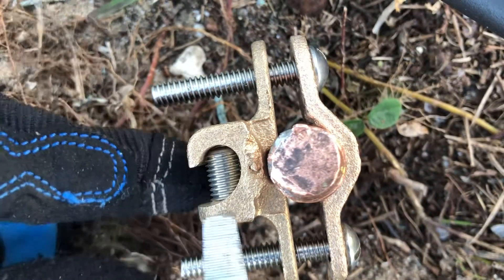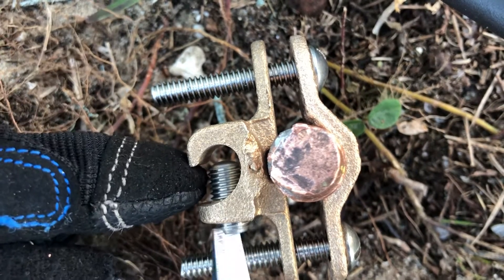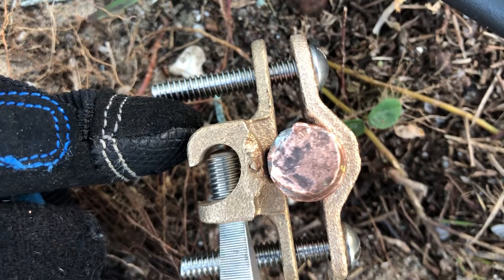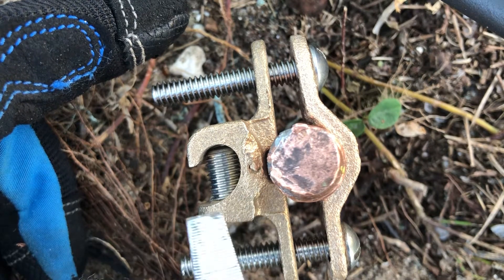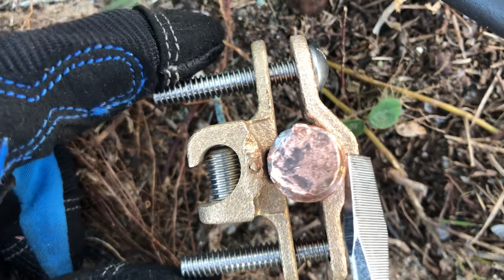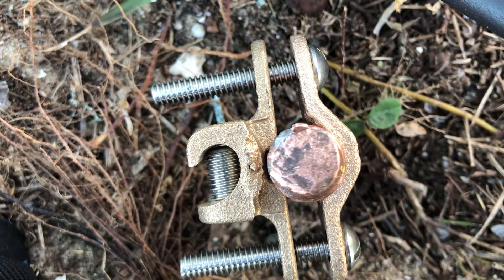This part here is another flat head screw that goes into this clamp. You place your grounding wire in here, tighten it up, and it pinches the wire in there and keeps it snug. That's the way I'll attach my grounding wire to this clamp, which would then allow electricity to flow to the grounding rod and provide a safe grounded generator. And that's pretty much it on attaching the grounding clamp to the grounding rod. Thank you for watching.